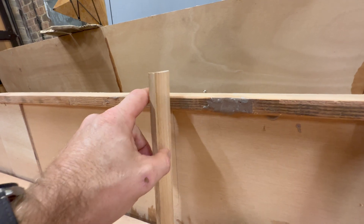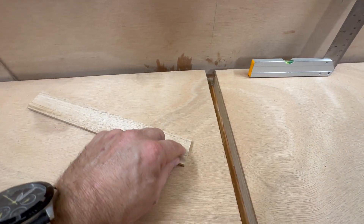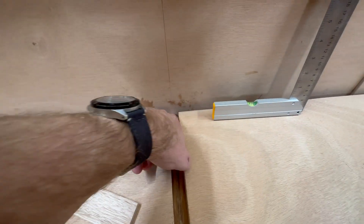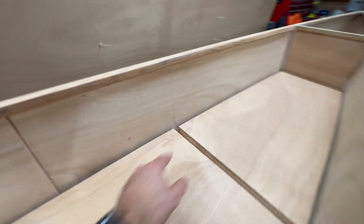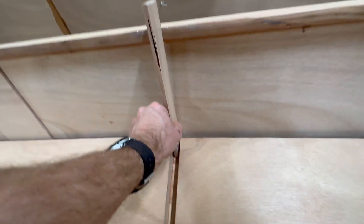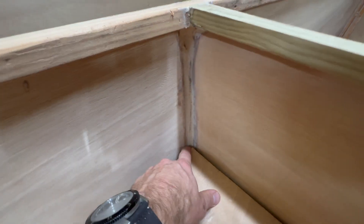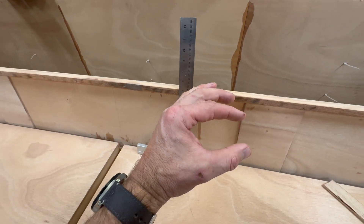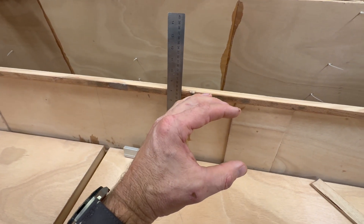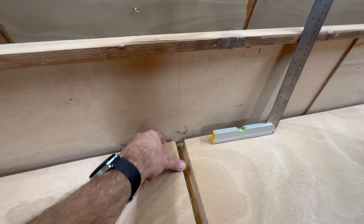So you can see this is my freeboard when I put in my self-draining holes for the cockpit. There are the bulwarks here, and there will be a drain hole cut out — a little half circle cut in the bottom — and then drain holes in this position and this position, with a support frame in between. Same drain hole there and a drain hole in each back. So any water that comes in has scuppers — 1, 2, 3, 4, 5, 6 — and each scupper will probably be about 30mm in diameter.